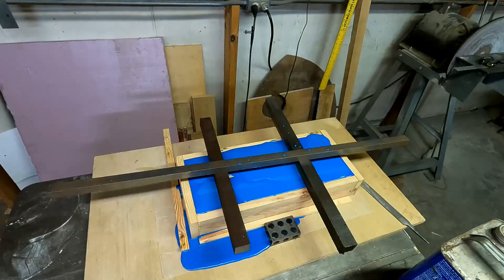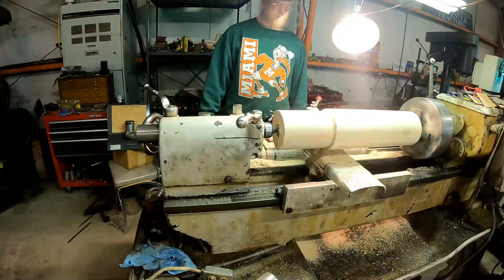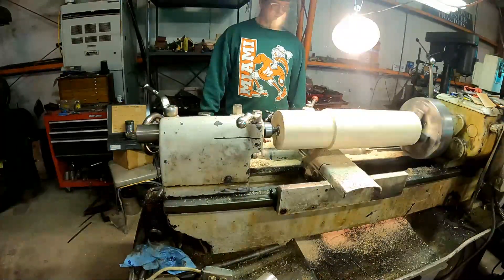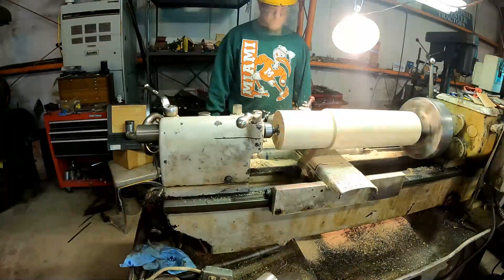Before we get started, let's talk about the pattern we had to make for those piston blanks. There's a separate video on the site covering that whole topic — it was quite involved, took almost two days, plus a day and a half of prep work. This is the core box filled with epoxy; that part of the pattern makes the inside of the casting hollow. Here we are turning the other part of the pattern out of wood, which dictates the outside diameter of the casting. It's a long process and there's a video on the site that goes through it.